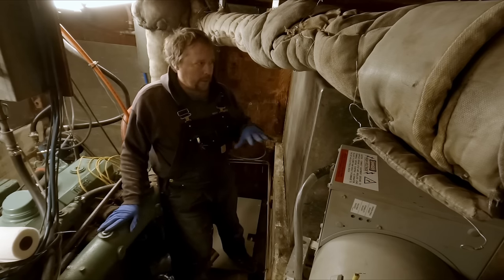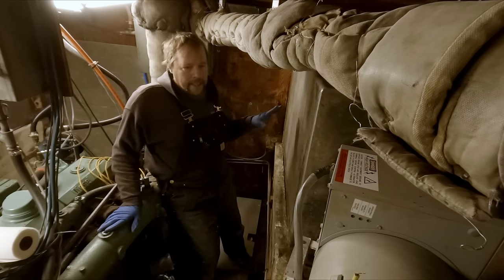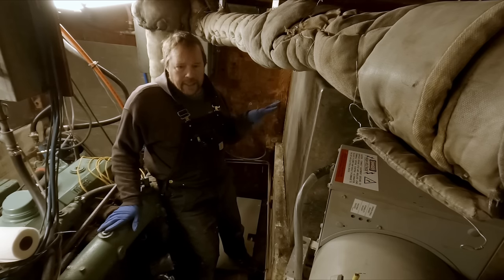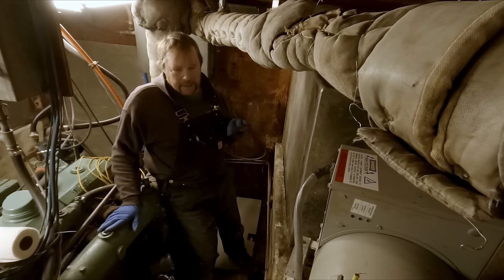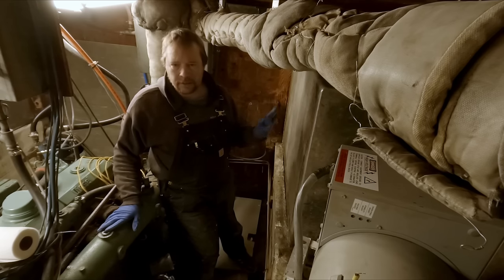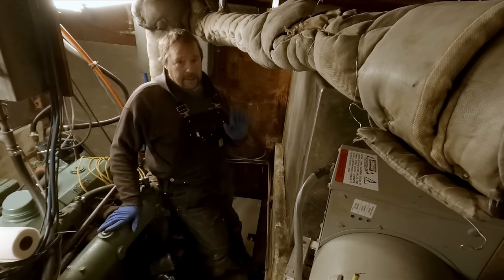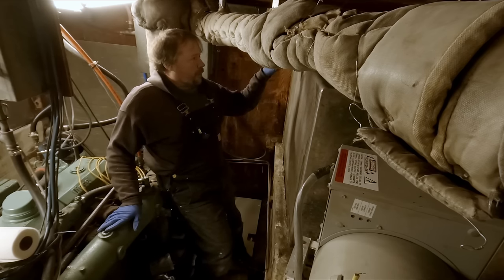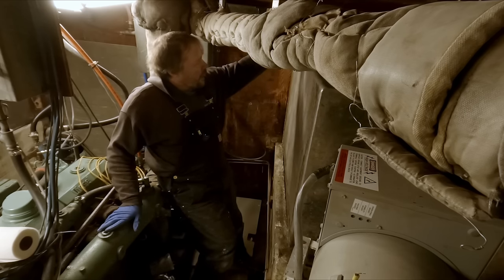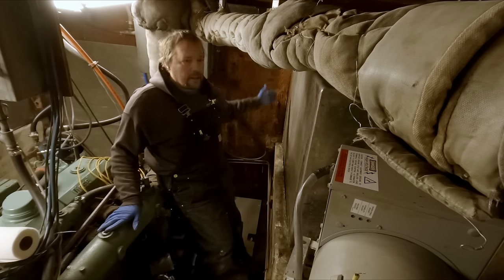And so going forward, when you start to rebuild things or repair things, it's important to take that little bit of extra time to change that mindset and not be reliant on adhesive that will fail after a while. Everybody loves to use 5200 and they think, oh man, this stuff is going to last forever because it's so hard to get apart. Well, the reality is it does break down over time and it does start to leak. And where you can't see it is where it really hurts you. And this is a perfect example of that, is salt water getting in here, running down that fill pipe, getting in behind this tank and this bulkhead in just the right perfect place.